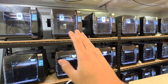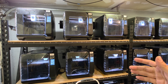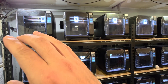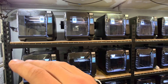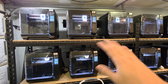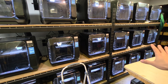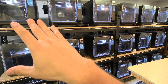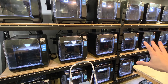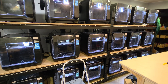You can get around this by staggering the printers — heat up one printer until it reaches its set point, and then the power going to the machine drops since it's just maintaining temperature. You go from about five to six amps when heating down to about two and a half to three amps. With all 18 printers heating up at the same time from cold, I witnessed 100 amps being drawn on my current monitors. I actually wrote software to control all of them to heat up at the same time, and it drew 100 amps — that's a lot of power.